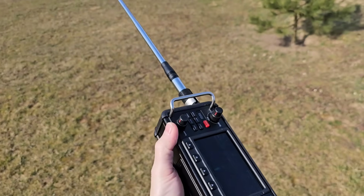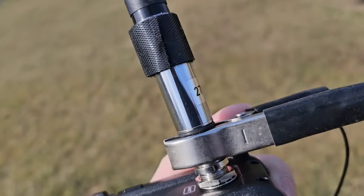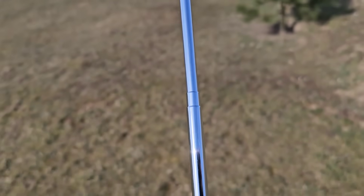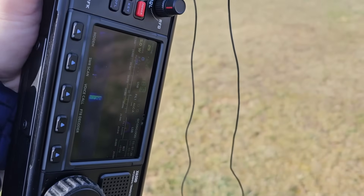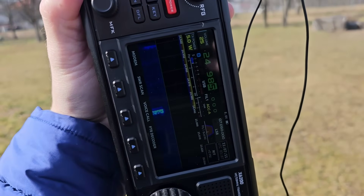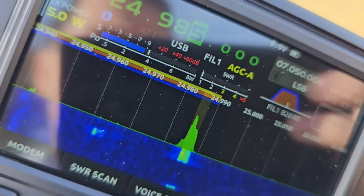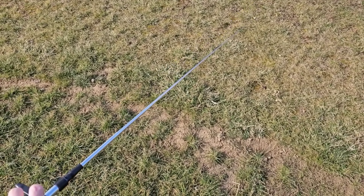So as you can see, I am working with the 27 megahertz antenna which you can see right over here. It's just a whip antenna, one element is inserted inside, so the antenna is almost at its full length. I'm using this combo of counterpoises which are currently lying on the ground. One counterpoise is made for the 10 meter band, the second one is made for 12 meters. I'm running only 5 watts, currently on 12 meter band at 24.985 MHz. The antenna is very short, actually maybe something more than one meter.